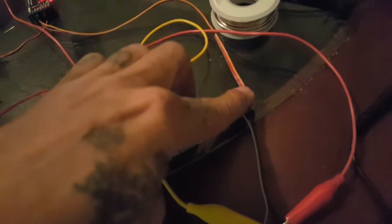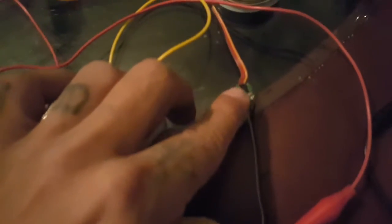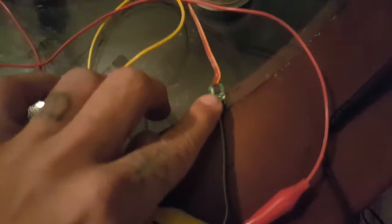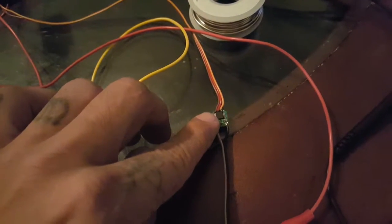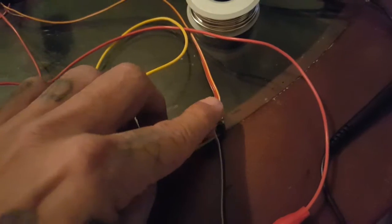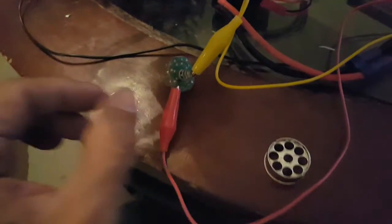The trick here is that now I'm pulling a lot of current through this thing, it might be getting warm — and yes, it is getting warm. So you're going to want to shut it off. The best thing to do with this little tiny chip on the board is just put a heat sink on there, and that'll stop it from burning out — that's if you want to use it as a switch to run spotlights.